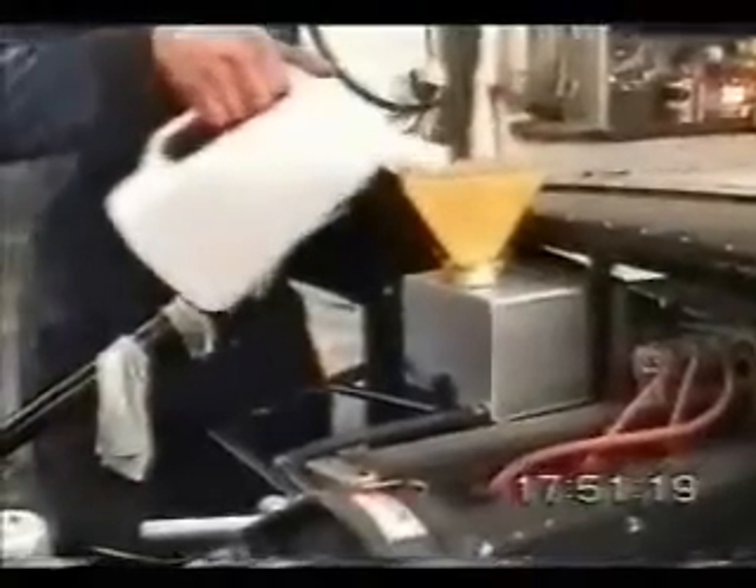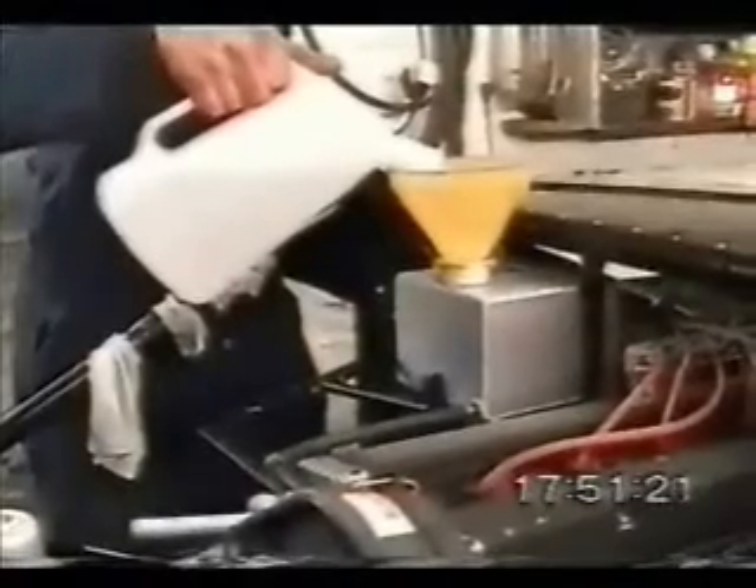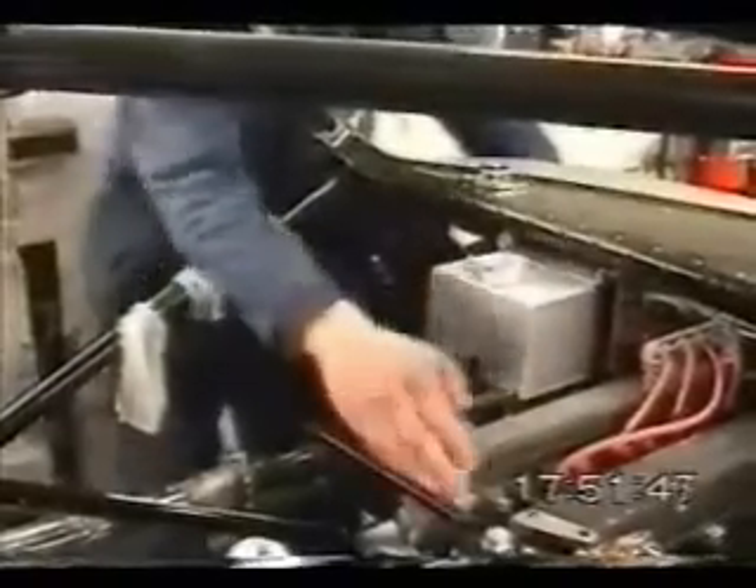Water for topping up — that's where I fill the water. Hopefully the water system is self-bleeding. The high point at the back of the head bleeds into the expansion tank, and from the swirl pot bleeds into the expansion tank. Top of the radiator bleeds into the expansion tank. So water can flow down there, and it will fill up the radiator and the air will come back out up to there.